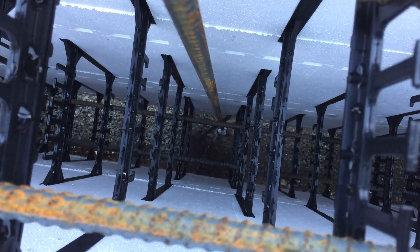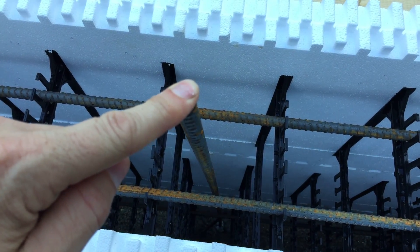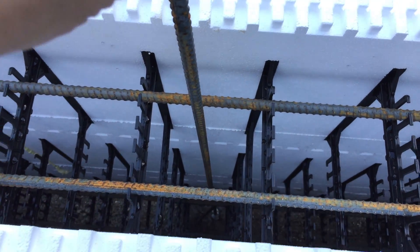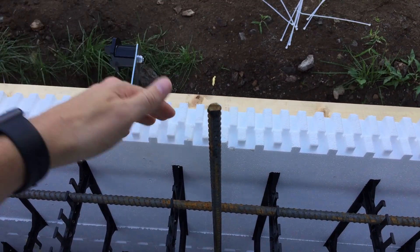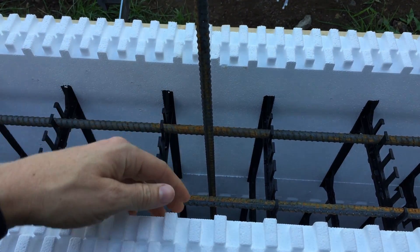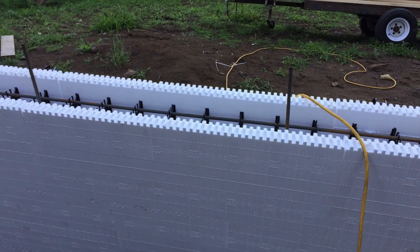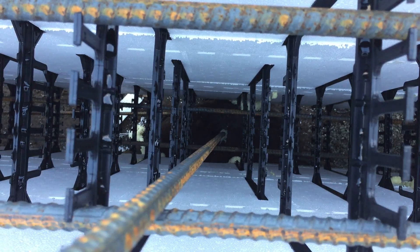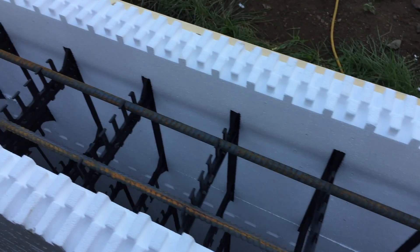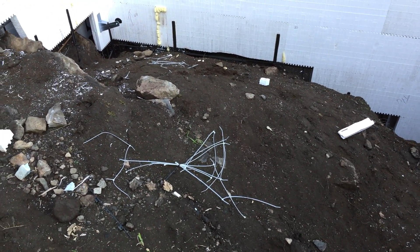This piece of rebar is epoxied into the ledge down below. It's technically on the wrong side of the wall — it should be on the inside — but I'm not really backfilling a whole lot here anyway. You want your vertical rebar on the tension side of the wall: if you had dirt backfilled on the other side, it would be pulling the wall this way, and you'd want your rebar there to resist that warping force. I was just happy to get the hole drilled in the rock. The one that's not epoxied in yet I'll zip-tie to the tension side of the wall as well.